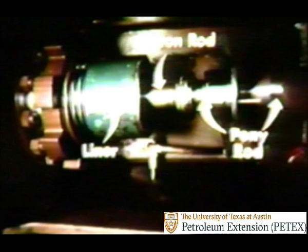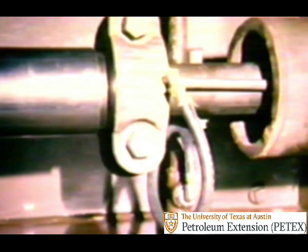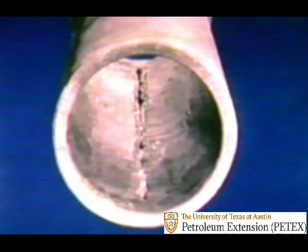Another possible trouble spot is the piston rod-pony rod connection. When you put the clamp back on, be sure it's screwed down tight—a loose piston will bang on every stroke. A leaky piston will dump mud down into the liner wash tank and should be corrected before a washout occurs. Sometimes, when the pump begins to knock as soon as you start it up, it could mean that the pump wasn't properly primed, which can cause all kinds of damage, especially to the resilient rubber piston head. It can be ruined in just a few strokes—this one was burned from improper priming.